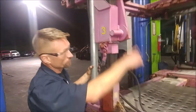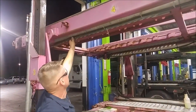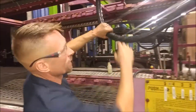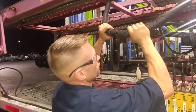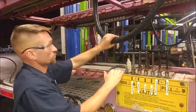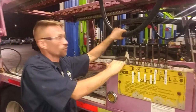You'd inspect the other cylinders the exact same way. The suspension cylinder has a little zip line, so that's a fairly clean look. The anti-chafing guard here is important to help prevent any burrs, nicks, cuts, or pinch points from anyone securing it too tight. These are available at auto parts stores nationwide — put them on and protect your hoses. It's a good idea to put them on almost any hoses.